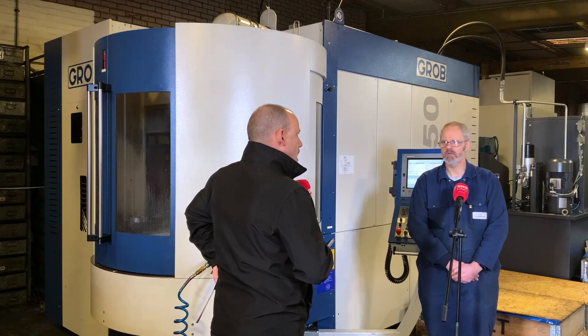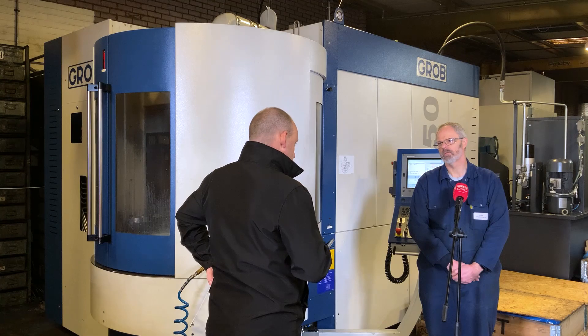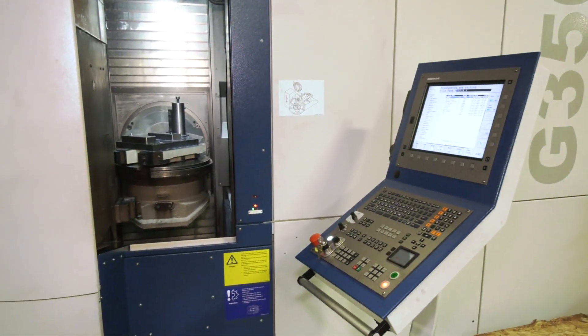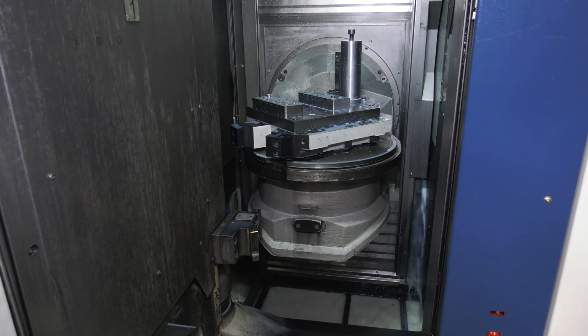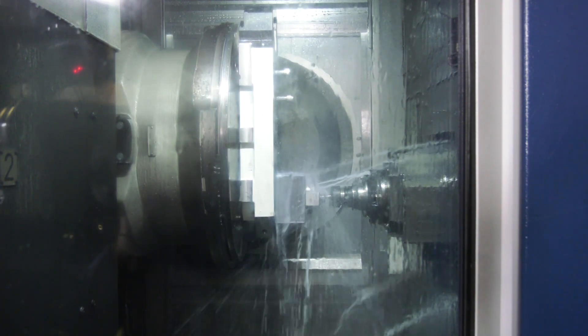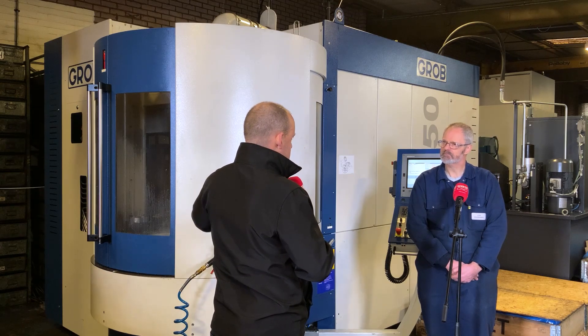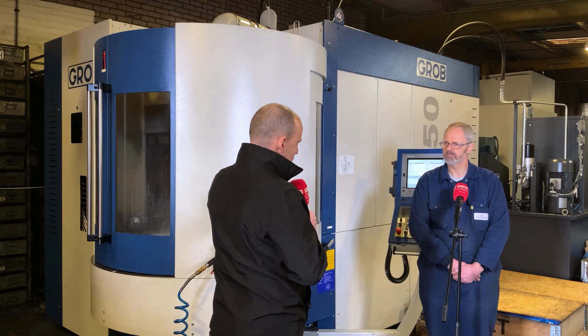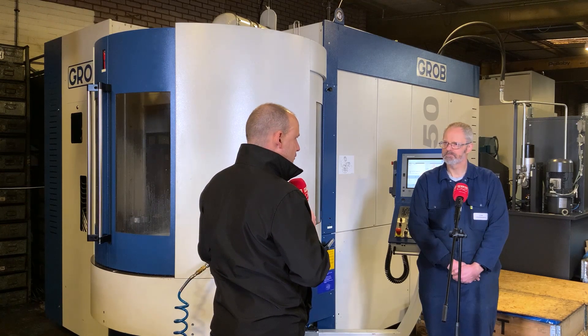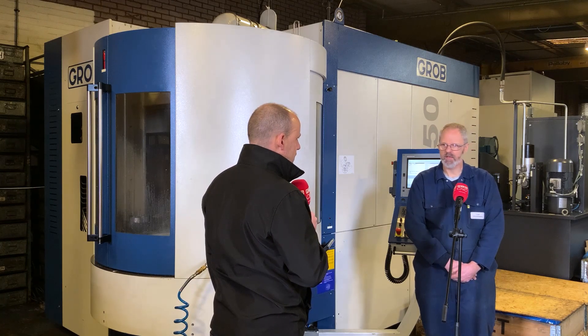This isn't your first five-axis machine, so what do you see as the difference between your other machine and this one? Obviously the Grob is a horizontal spindle configuration — we've got horizontal machines here already. We haven't done that many jobs on the Grob yet, but on one new job we've already seen a very good surface finish achieved very easily. We're able to interpolate a bore, hold a size, and achieve a really good surface finish without trying particularly hard.